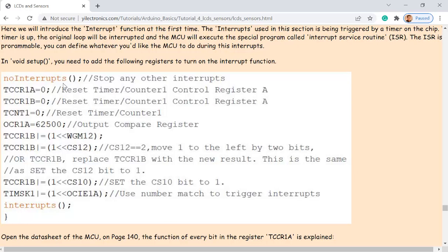However, if you plug the temperature sensing data into the main loop, you're not going to see that display continuously. It won't show you that steady display anymore, you know what I mean? Because it has a different delay. It's adding a different delay within the scanning of all the digits. So if you have that temperature sensing code in the loop, it's always sensing the temperature, which is not necessary, and you are not seeing a very good display on the four digits.